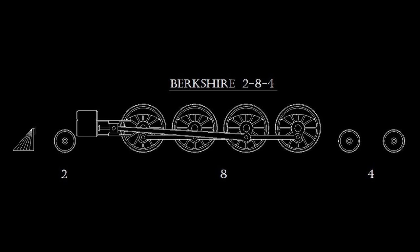In 1924, Lima introduced the 2-8-4 wheel configuration, and it would ultimately render all previous freight locomotive designs obsolete. From the very beginning, railroads tried to squeeze as much power as possible from each new locomotive design, but always ran into the same two constraints: the existing railroad infrastructure's ability to handle ever-heavier locomotives, and a fireman's ability to shovel enough coal into the firebox to maintain boiler pressure. The end of World War I and the eventual dissolution of the USRA returned railroads to private sector control — a mixed blessing. The wear and tear inflicted on the railroads led to a need for massive post-war modernization of railroad infrastructure, specifically tracks with heavier rail, which is one of the things that led to the rise of superpower steam locomotives.